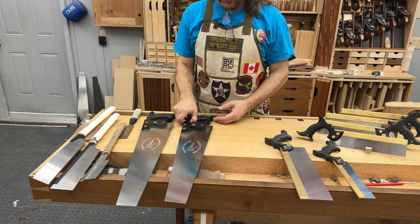Give me a few minutes and I'll introduce each of the nine saws that we make, give you a quick brief on what they're used for, then wrap up with what I consider the necessities. The first one is for small work — here's a small men's jewelry box using little tiny dovetails in quarter-inch stock. My regular dovetail saw was causing the board to bend and flex while I was cutting, so we developed a smaller saw. Thanks to the inspiration of a friend's father — a World War II vet named Leonard Robichaud. We named this our Len Robichaud three-quarter saw. It's a 15 thousandths blade, 22 teeth per inch — ideal for small work.